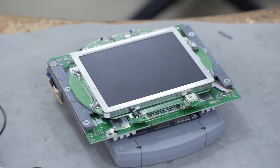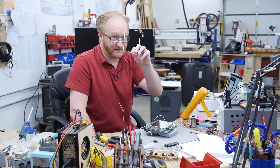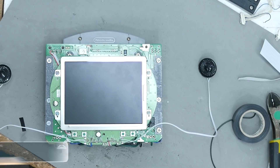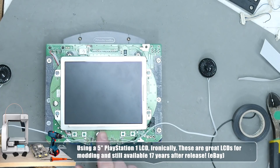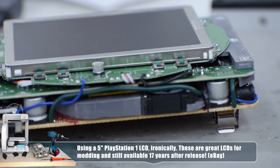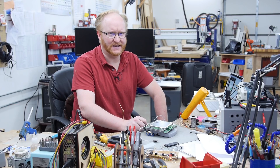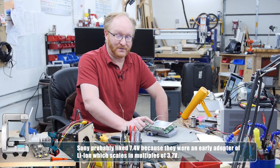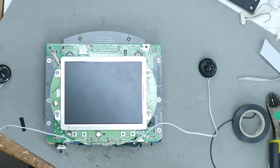I modded the screen with LEDs instead of the U-shaped CFL, which contains enough mercury to kill a hummingbird. Now I'm switching it on — we have video and left and right audio going to the screen, hooked up to the 7.4-volt power supply because that's what the screen uses. I have some speakers bodged in so we can hear the audio. The nice thing about this screen is it has an audio amplifier built in — one less thing to worry about. This is pretty much the complete unit, sans controller.